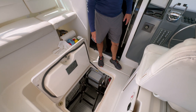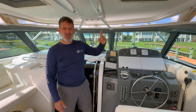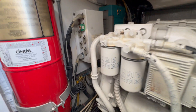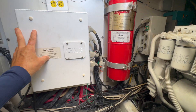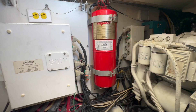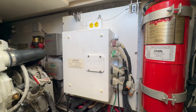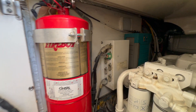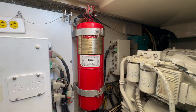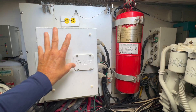We're going to take out the old system. It's pretty much easy — we have a nice little run here. The only obstacle is running the CAN bus cable up to the tower. We're working with a set of Volvo engines on this — these are the old Volvo engines. When we install the new system, it's going to have to be programmed so that the Volvo can accept the throttle input. This is the old processor, and you can see it has the Deutsch connection like the new one does. That's the backup box right there. We've done some work on this boat before, but he no longer has backup because we suspected there were issues with it.